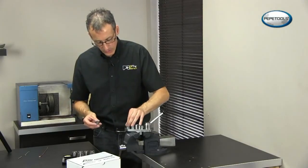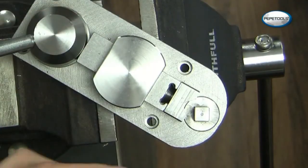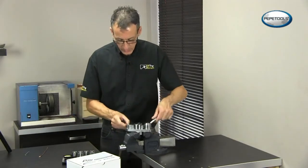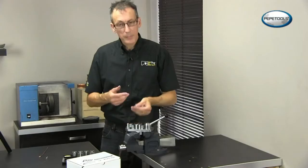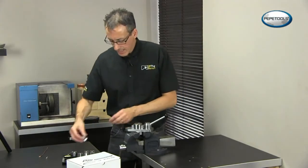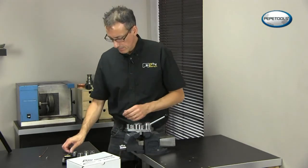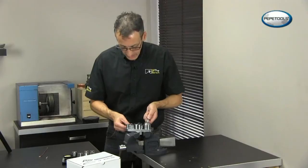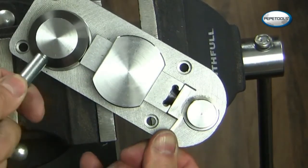The nice crisp 60 and 90 degree bends are lovely and crisp as well. Pop some square section wire in and bend it and that will produce a really nice crisp sharp corner. Because the bending tool allows us to bend really thick metal, it's absolutely fantastic for making spoon rings for instance. This is a 20 millimeter die here — you can take it around and make some gorgeous graceful curves.